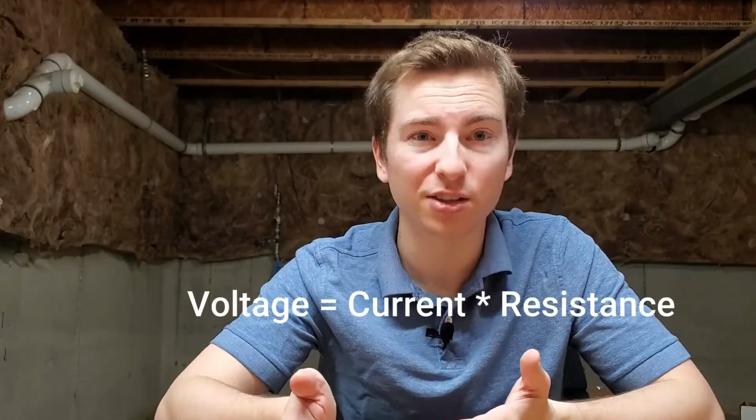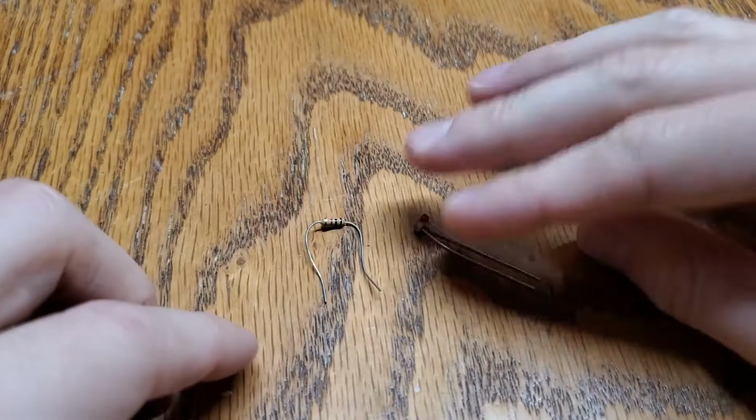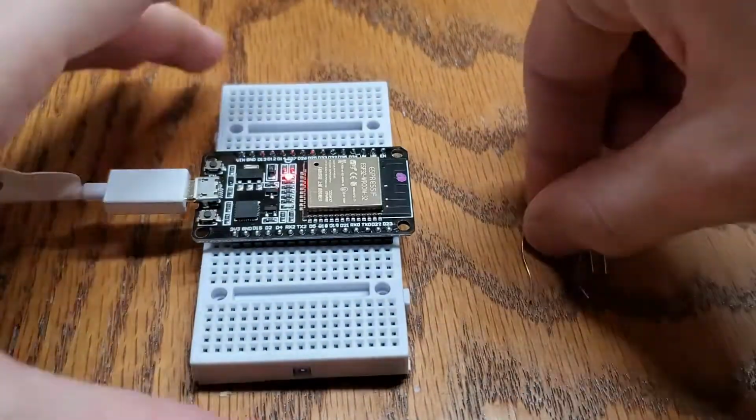Photocells change resistance based on how much light they're given. There's no way to measure resistance per se, but putting a voltage across a changing resistance gives a changing voltage, which is a thing microcontrollers are well equipped to measure. However, unlike with the laser diode, you can't just put 5 volts directly across the photocell and expect results. A constant 5 volts and a changing resistance gives a changing current, not a changing voltage. So we need to add a constant resistor in line with the photocell.